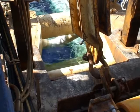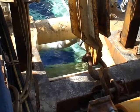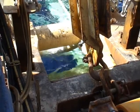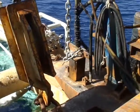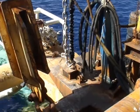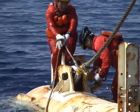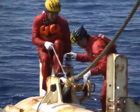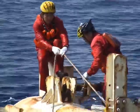Before pipe laying operations begin, the stinger is lifted off the deck of the Java Constructor and secured to the stern of the lay barge by what is known as the hitch, which has hydraulic retaining pins on board the barge to keep it in place on the hitch. After that, the lifting strops are removed, so the big rig crane is free for use in other lifting operations.